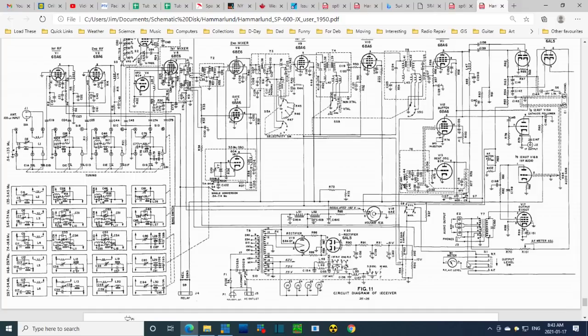Oh, maybe if I have a speaker hooked up. Well, what I've got hooked up here is 50,000 ohm impedance on these output terminals here. So that's another resistance path, and that's actually skipping around the outside here. Expect 600 ohms, and I've got 50,000 there anyway. Let's carry on and come down here. Yeah, because it's audio and the switch is disconnected here.